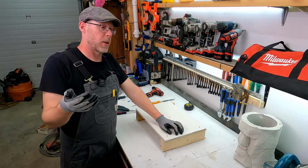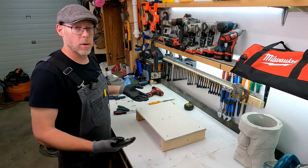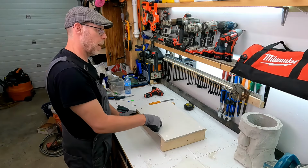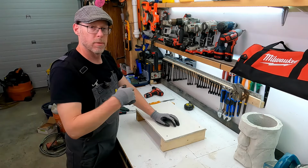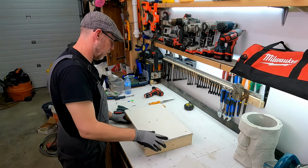For most people, you're going to have trouble finding the studs. I mean, you can't turn your wall around like this. You can do the age-old trick, which is you tap along. The hollow spots in the center are in between the studs. When it sounds really firm, solid, that is where the studs are. Even here, I can give you the example.